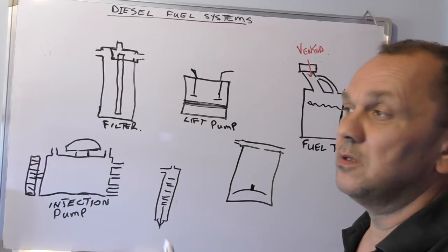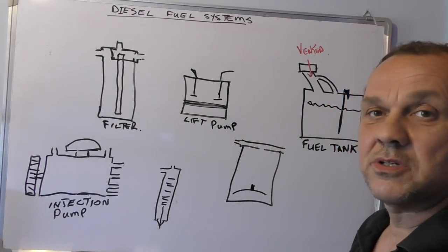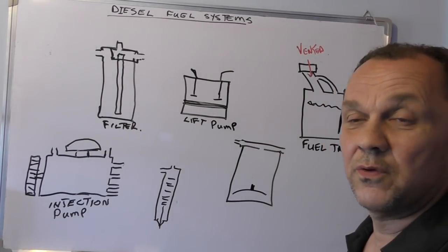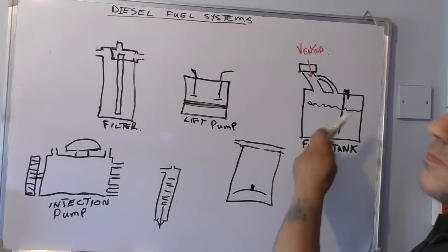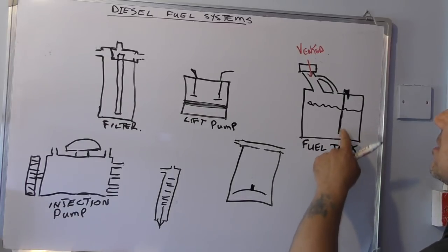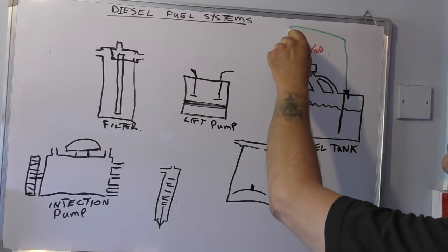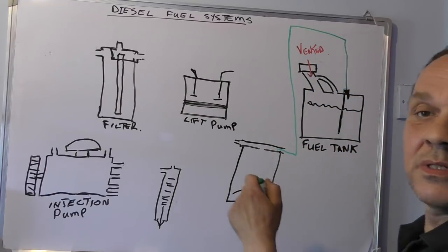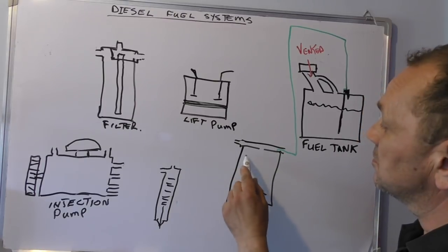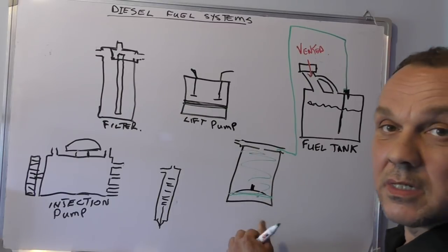What we're going to do is build the fuel system first. I'm going to start with the dirty side first, because we have a dirty and a clean side for diesel fuel. So we'll say this is our stack pipe — what we want to do is take a pipe from there and then put it into our sedimentor. The fuel fills up — because usually it's a glass bowl — so it'll fill right up and the water should stay at the bottom.